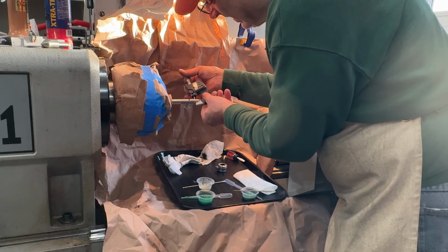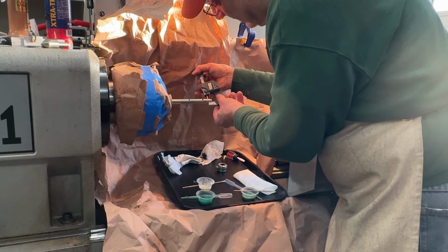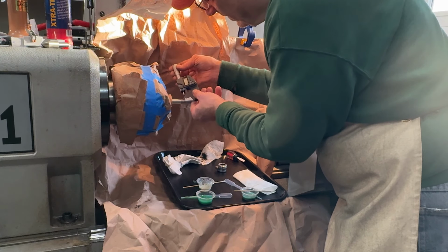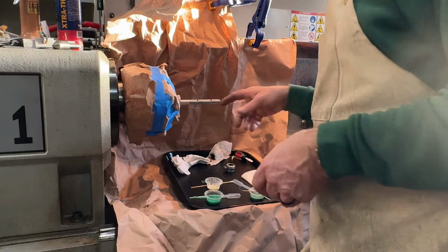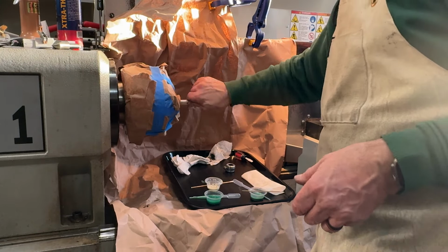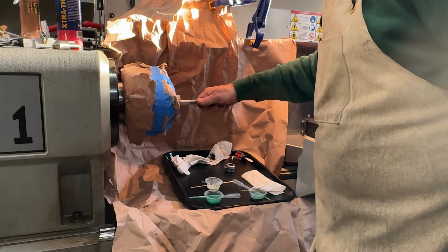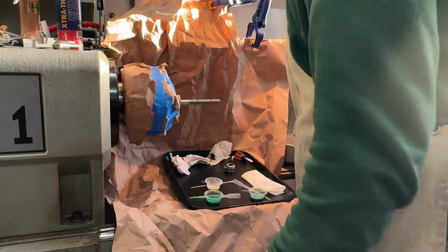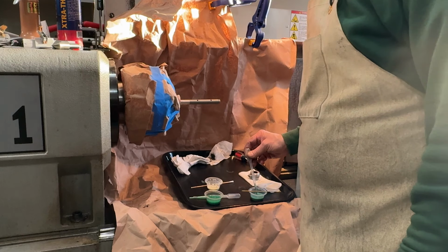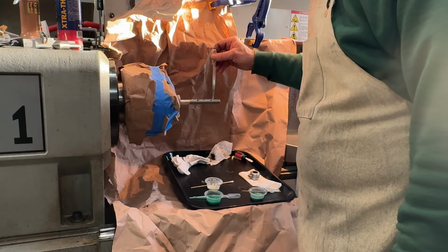So it's actually 6097, and at the bottom, or the side near the nut, it's 60955. So still a little taper left to come out. I think there's a little ovality in this inside part. I don't know why, but we're just going to lap some more, just like we were doing, and just concentrate on the upper two-thirds.